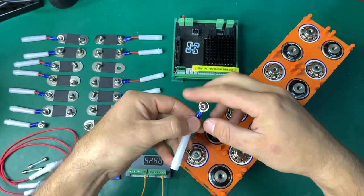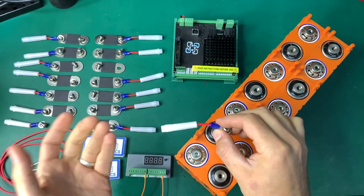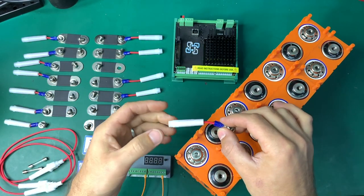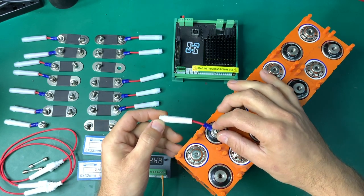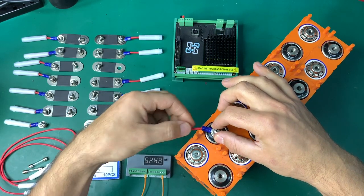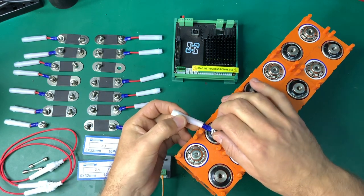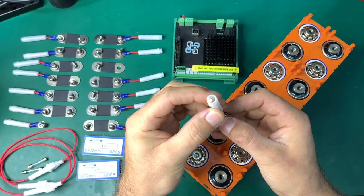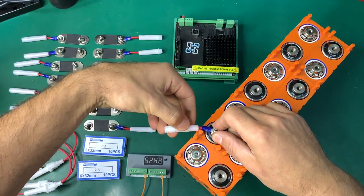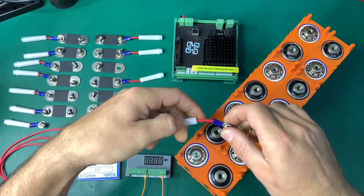This is what we pre-wired here — the shortest path we could do with this fuse holder. They're bulky but easy to demonstrate and unplug. We try to keep it as close to the energy source as possible, while still having space to replace the fuse. The contact inside is brass, and it's designed so you cannot accidentally touch or short the neighbor cells.